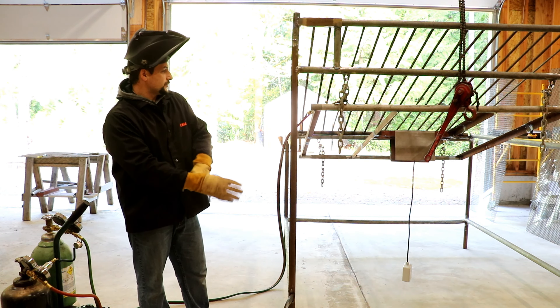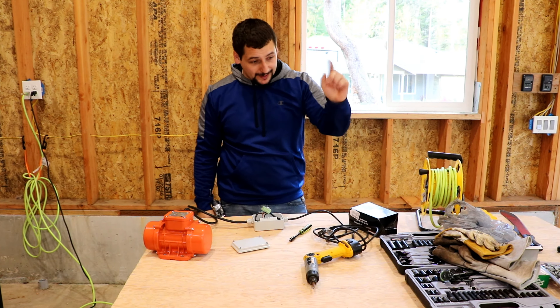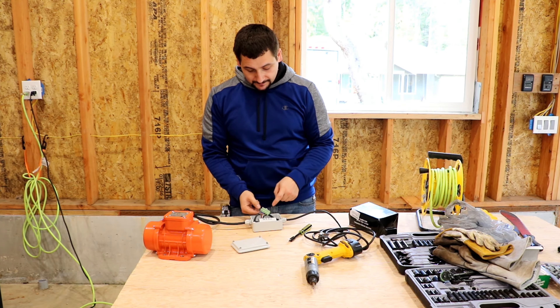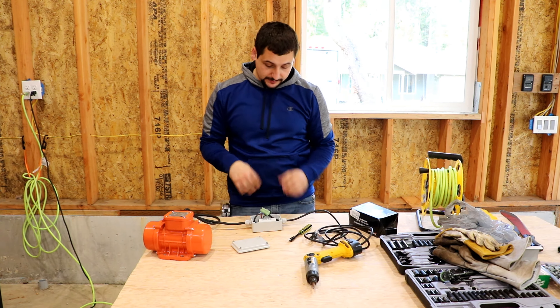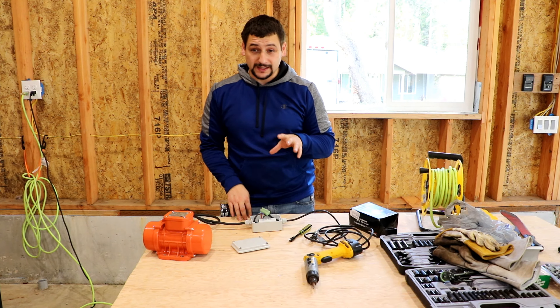I know that and I'm going to go buy one and wire it up correctly. But in the meantime, because I want to test a couple of things and I haven't turned this thing on yet, I want to plug it in without a ground — and I know that's not right. I want to see how much it shakes, how well it works, and if I can get away with some different type of wire. I have cut off the plug from my grinder, stripped the end, and wired it into the connector terminal. The instructions weren't in English, but from all that I determined hot to hot, neutral to neutral, and I would normally have a ground wire but I don't happen to have a plug with that. I am going to discharge the capacitor when I'm done with the video — I'm not showing that because I don't want to lead somebody down the wrong road and get them shocked.